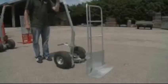Move the transport cart to the transport blade from behind. The blade is secured to the rail of the transport cart with a pin and a safety hook. The bracket matching the transport blade is fixed to the blade from the top. The Allen screws will fix the brackets to the blade.